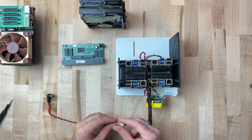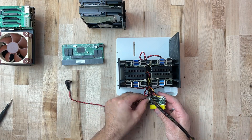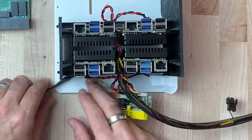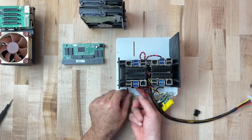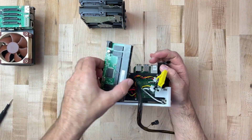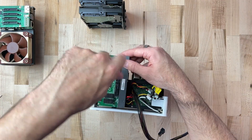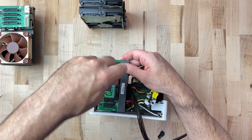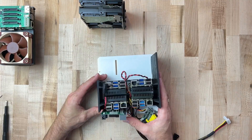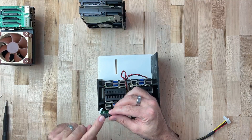Next, let's get the power for the switch installed. This is going to be this other pin header — make sure it's the right one for you. That's going to supply 12 volts that I'm reducing down to 9 volts to feed into the switch. I'm just going to tuck this little shrink-wrapped voltage reducer in there, wrap my cable up, and then our switch is going to go right there. Line up on those two little standoffs we created, set the screws down — not too tight, remember you're going into 3D printed plastic. They're plenty strong enough to hold the switch in place, and this is our 9 volts in for the switch. Get that plugged in.